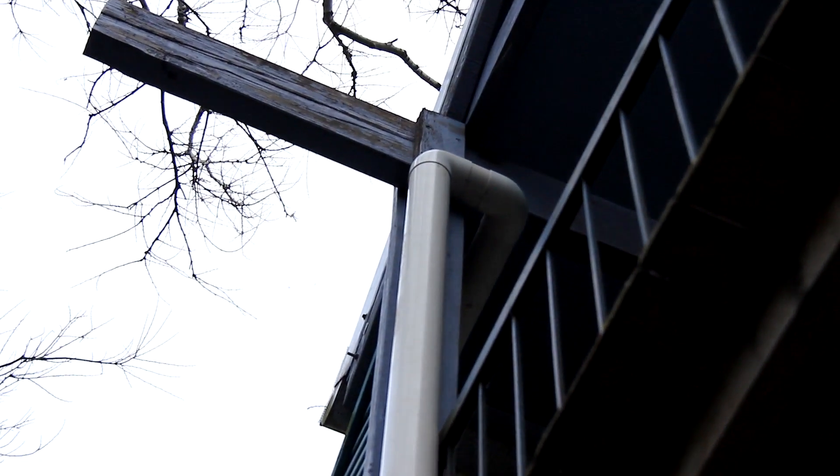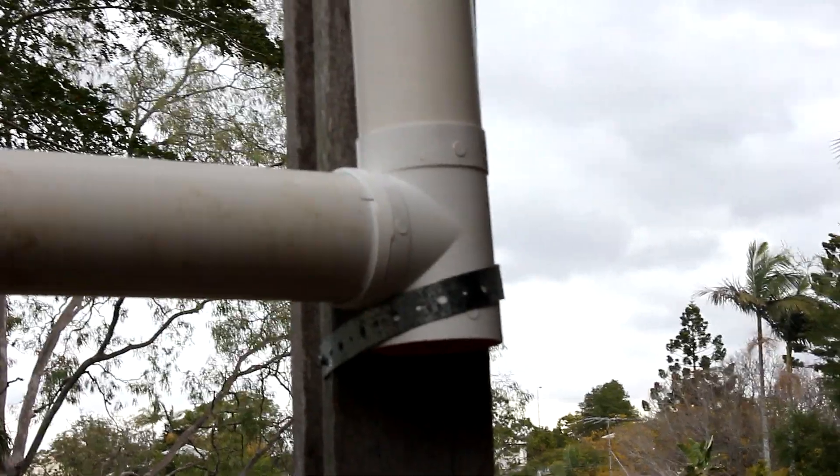So I've plumbed in my water tank. That's the downspout on the very front of the house. It goes down, comes across all the way underneath the house, takes a turn, joins the downspout from the deck, and comes down to that little T-intersection where it cuts across and goes straight into the tank.